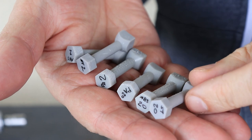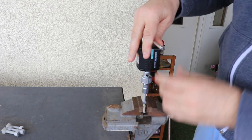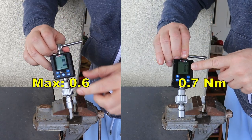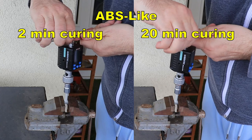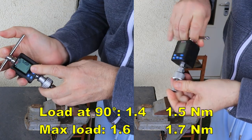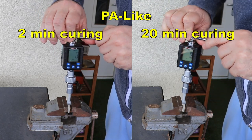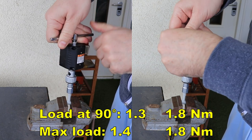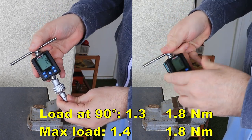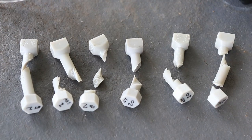Time for the torque or twist test — this test object has a diameter of 6mm. I will rotate them and measure the torque with this torque meter. Starting with standard resin — very brittle, I just started with the rotation and it snapped very quickly. Next was ABS-like — definitely much stronger than standard resin, and I could make maybe half a rotation. And then PA-like — also very strong, I could make almost one full turn. What is common in all three cases is they are brittle materials with very sharp broken edges, so it is very important to wear safety glasses.